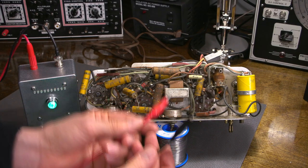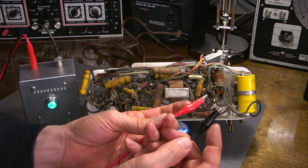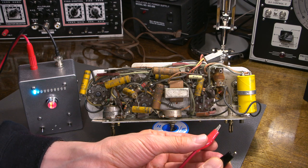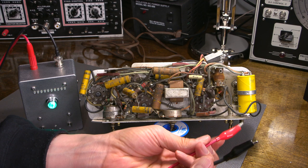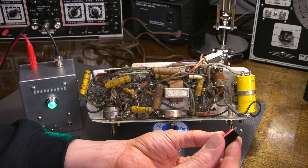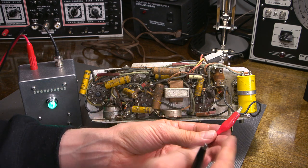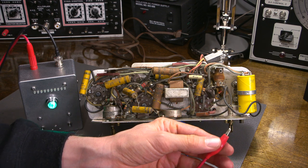I neglected to mention before that when I was touching the boots, it's measuring my body resistance through the vinyl - that's what it's doing. If I stick this into the forecast position again and just hold onto the boot here and here - it's measuring my body resistance. Even just holding this cable - just touching the boot, not touching anything metal - it's measuring my entire body resistance through this vinyl. That's how incredibly sensitive this is. There's filtering inside the box to stop RF or noise - this is just looking at leakage resistance.